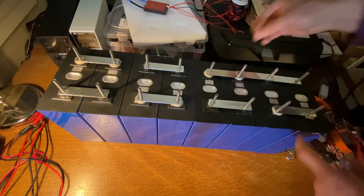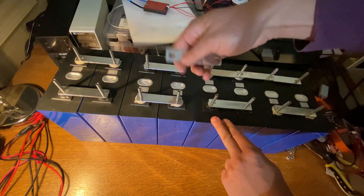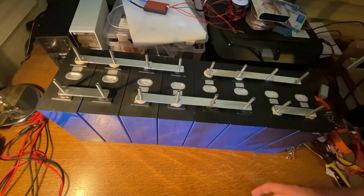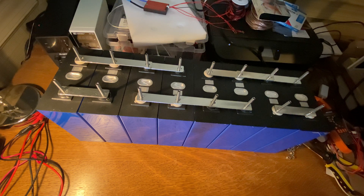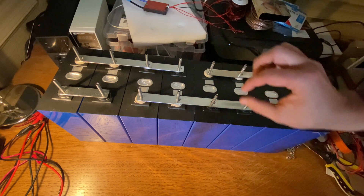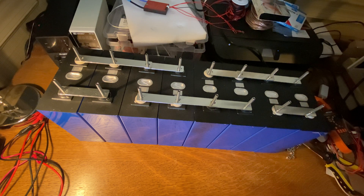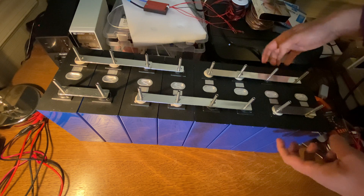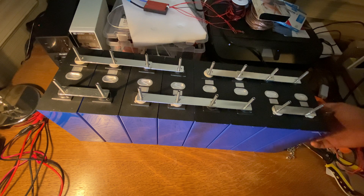This is my main cell negative, so I go to the next cell's positive and connect it to the negative there, then alternate — negative to positive, positive to negative, and so on through all four cells. Importantly, if you're going to push a lot of power through this system — this is a 560 amp-hour 12-volt battery — you'd want to double or triple up these bus bars, or use much thicker custom copper bus bars. This arrangement is just for demonstration. Now we have a 4S battery where each series step is 2P — two cells in parallel.